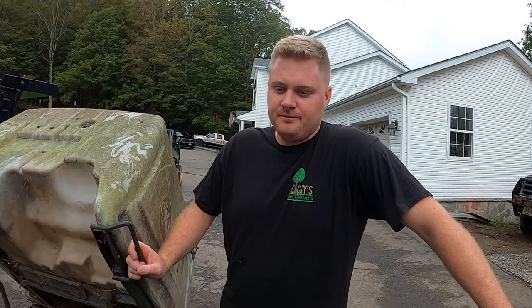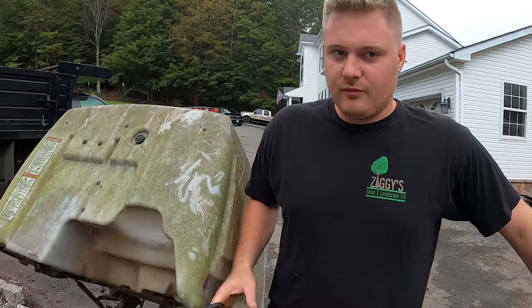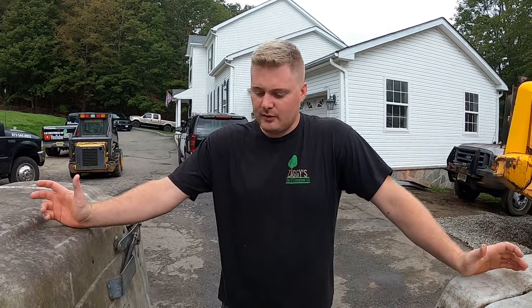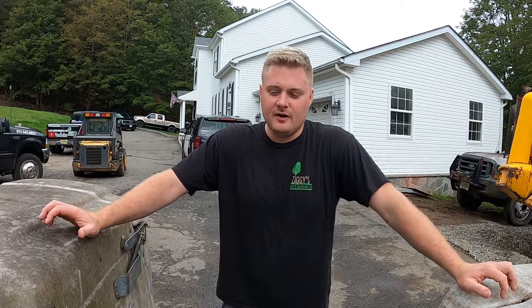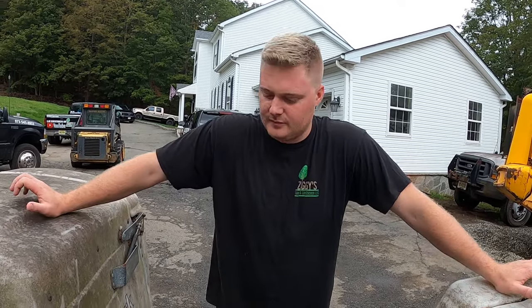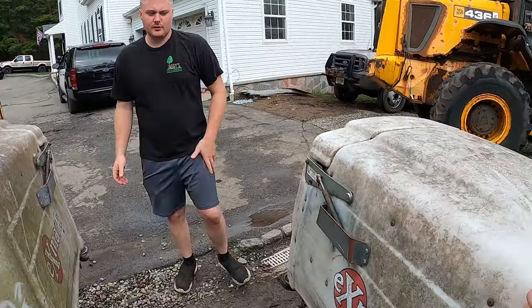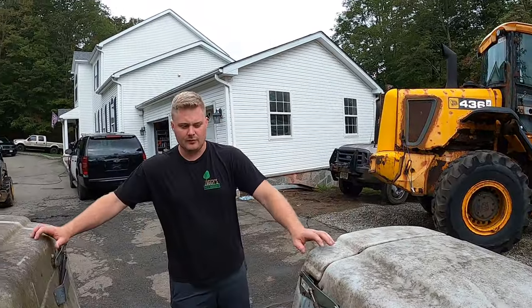They have plastic cooling fans — if you get a stick or clump of grass in there it'll take the fan and could overheat. We keep a ton of those in stock for our flips and for our mowers, because we don't want a ten-dollar fan taking out an eight-hundred-fifty-dollar hydro. So we keep them in stock at all times. We paid a thousand bucks for the pair.